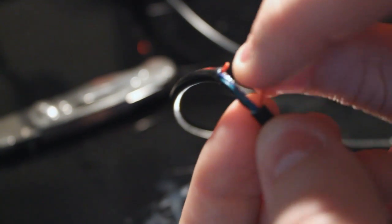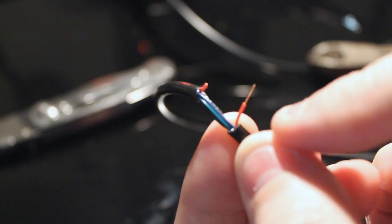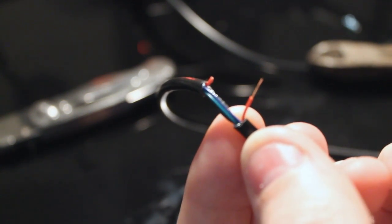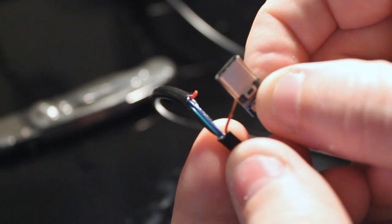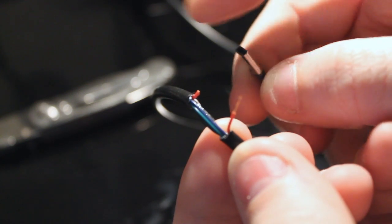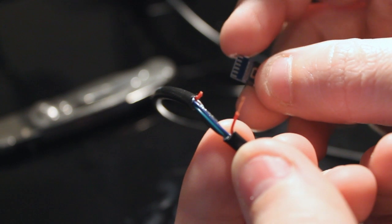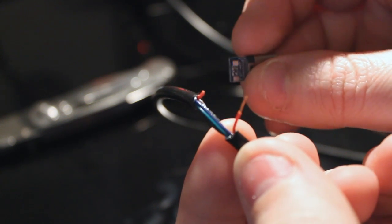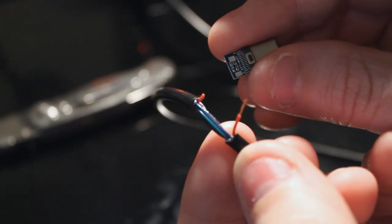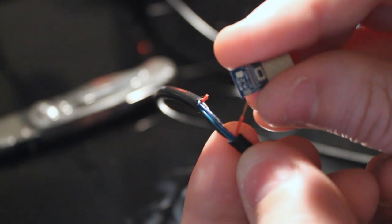So this is going to connect to our power supply, and if you use Raspberry Pi, it's just going to go into the USB cable. In my case, I'm going to go to a hopefully good enough to work Chinese-made USB-C plug, because that's what this dock has. I don't care about any of those data contacts, but what I do care about is that one of those is labeled D and the other is labeled G, which is kind of hard to tell.